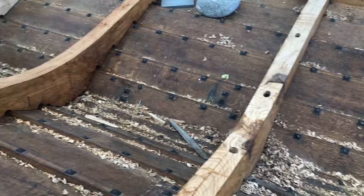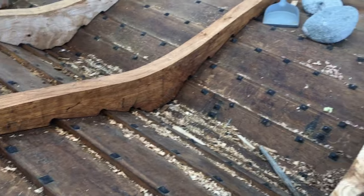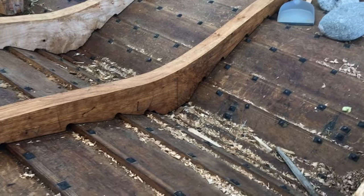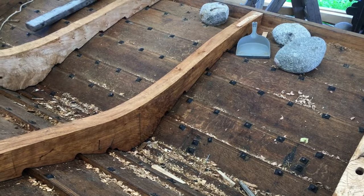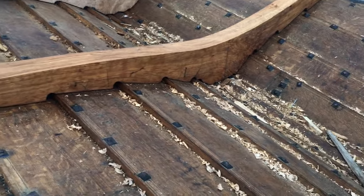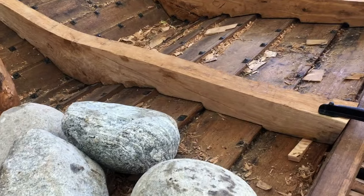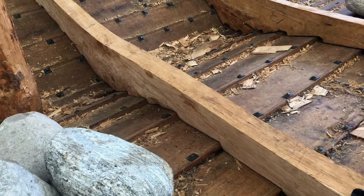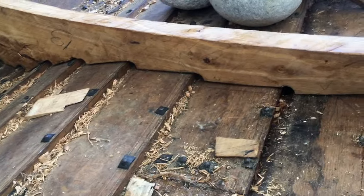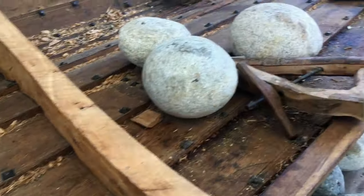The difficulty with these pieces is that they are made with timber that's at a point where the tree divides, like a branch. Because of all the reaction wood that grows, it's kind of unstable as it dries. It makes the piece of wood move, shrinks, and in an uneven way because the grain is going all over the place.